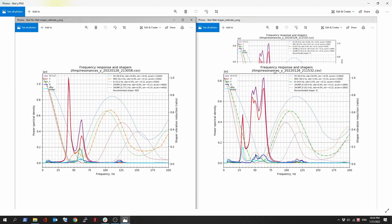Now if we take a look at Y — on the left we're hitting 1.2 or 1.3, but take a look at the scale: 1E3, add three zeros. On the right, 1E2. That's about 10 times lower vibration or resonance vibration. So that's crazy — there's a big improvement right there. That has kind of told me I was right to bolt it to the wall. There's definite less vibration, either on the printhead and on the print bed.